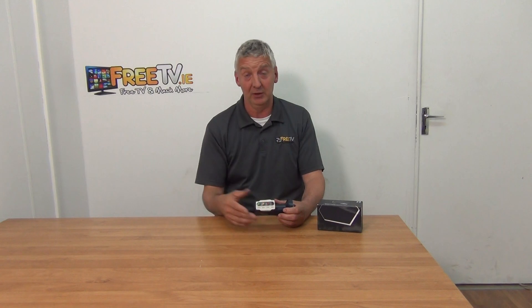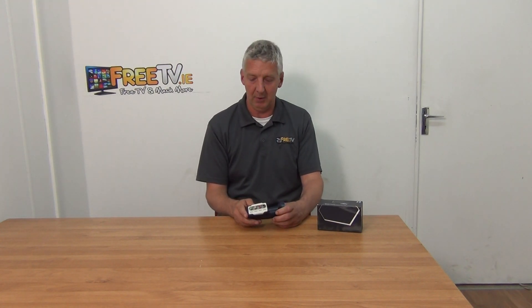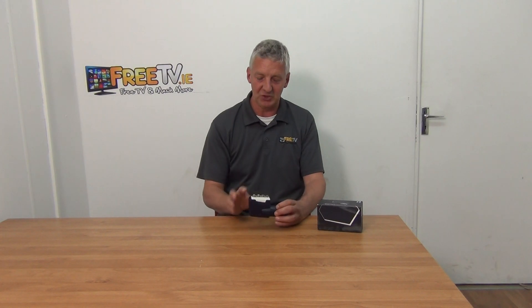This is four-way but internally it could supply 32 different set-top boxes. What it does is break the signal coming in from the satellite into a vertical high, a vertical and horizontal high and low — basically four signals, each color coded — and you run that into a multi-switch.